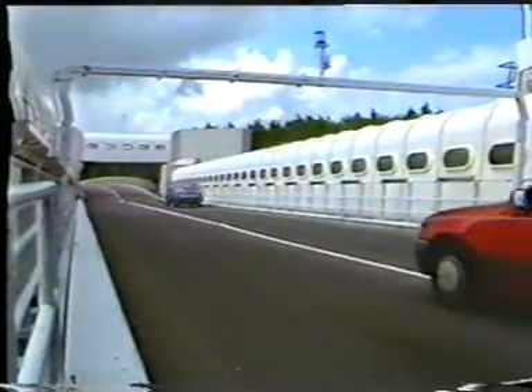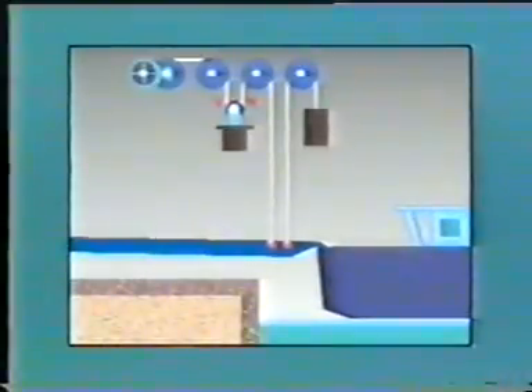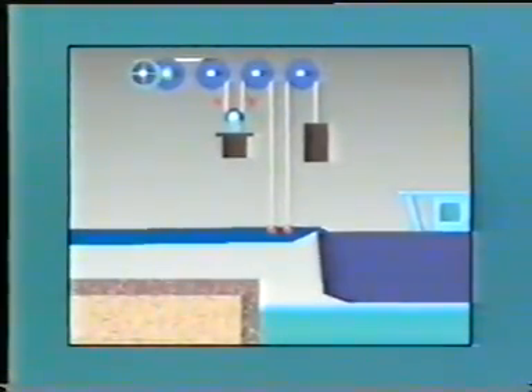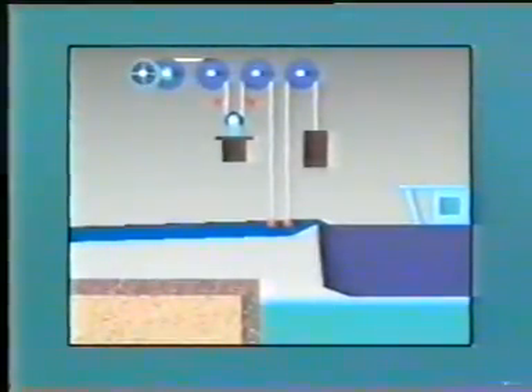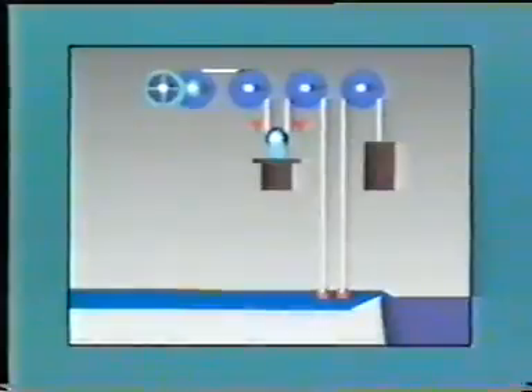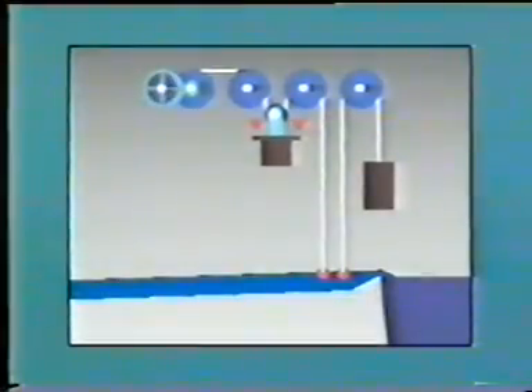Tilt, trim and tidal movements should be accounted for in the operating mechanism. The bridge is kept in equilibrium by counterweight cables between bridge and counterweight. In the operating cables, a loop is introduced including a relatively small counterweight — the cable tensioner. In this way, clearance is created. The bridge can follow the displacements of the ship without effect on the motors because the cable tensioner and the clearance produce a constant tension in the cable. When the cable tensioner is lifted and the clearance between support and tensioner is exhausted, the operating cables become effective to move the bridge.